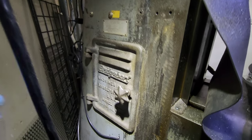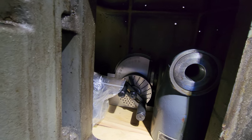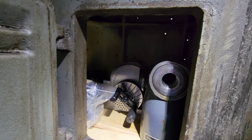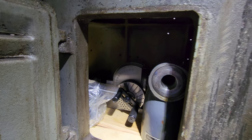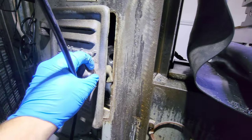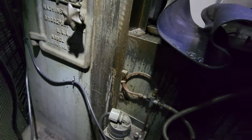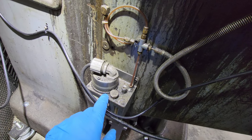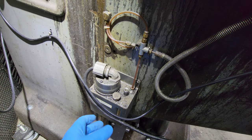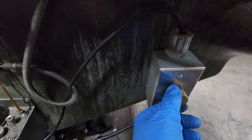Right here, this little storage box is where I keep my right-angle drive adapter and my dividing head — they just sit in there and I have a piece of wood cut to size in there. Down here you can see my Bijur — I'm probably butchering the name — this is just an electric oil pump, so it just pumps oil up. Anytime I have this turned here — that's just a timer — it runs this pump.